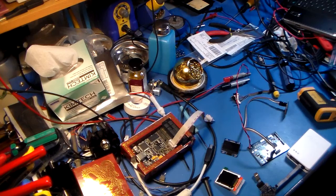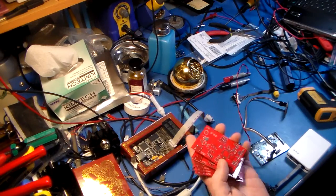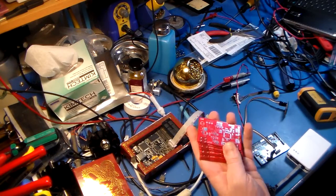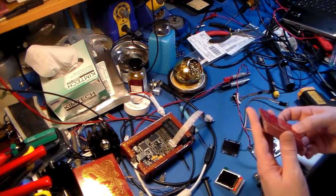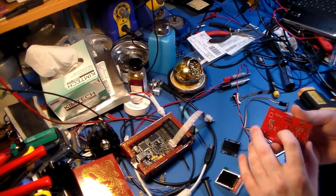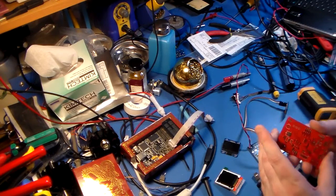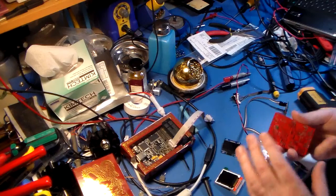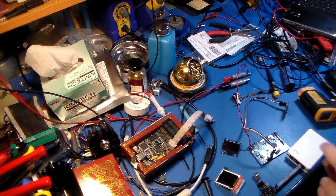So anyways, I have these boards here, and I had a stability problem with temperature. In mobile units, I'd throw a radio in the car, and it'd get baking hot, and it would just drift around. It'd get hot, and you'd have problems with it. But it had a footprint for a crystal. Long story short, the SI 5351 data sheet didn't say you could use a temperature compensated crystal oscillator, it just sort of alluded to it. So I mucked around with it and found out that it worked just fine.